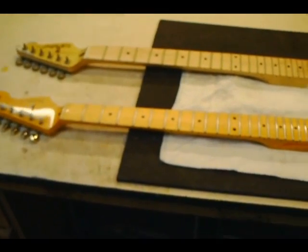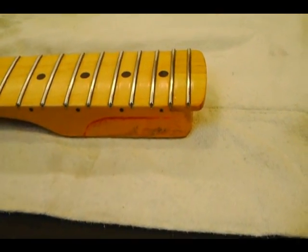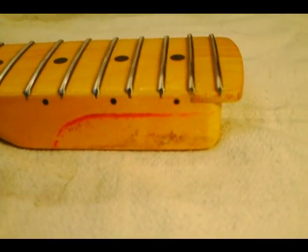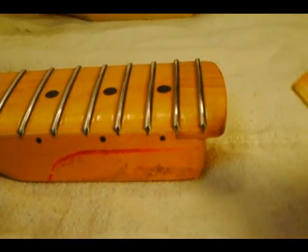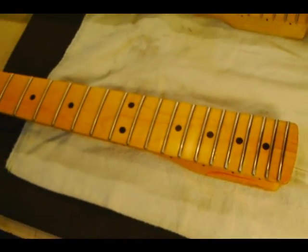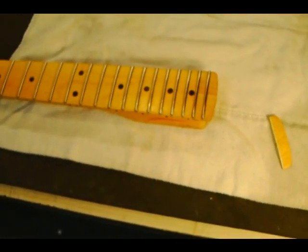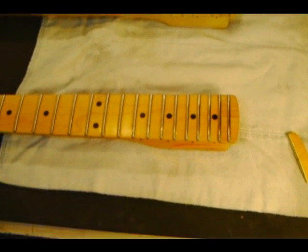So here's the finished product. There's that neck — it used to be 21 frets. If you look close there, you can see where that piece has been replaced. Let's bring the light around there. That piece I cut out, which is right here, was right there, and then I added that piece on. So now we have a 22-fret neck. I've re-fretted the whole thing, and I'm going to level the frets and install the neck on the guitar and set it up — another happy customer.